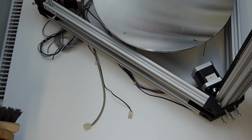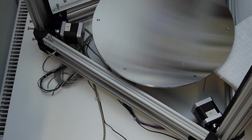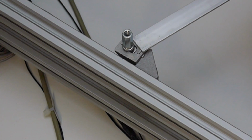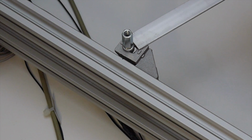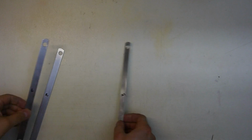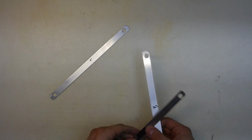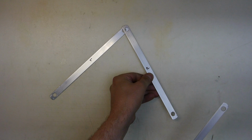Since the wool is rather floppy and wouldn't stay in place unless properly supported, I'll be using 3 aluminium bands to hold it in place. To make it easier to mount the bands, I've decided to flatten the top sides of the mounting brackets. Off camera, I cut the aluminium bands to size, rounded off the edges and drilled holes large enough to slide them over the hex posts holding the bed.